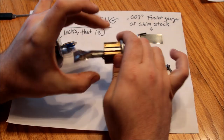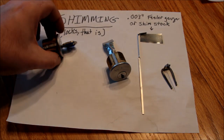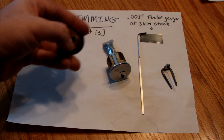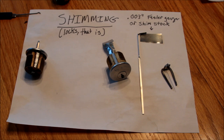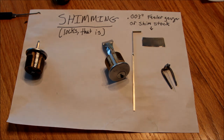Get it to the front and pop the plug out. Obviously on any well-constructed lock this will only work from the rear of the lock — we're taking advantage of the fact that we can access this little space here. On really poorly made locks you can sometimes do it from the front because the tolerances are so bad that you can get the shim in. This may be a bypass that some of you can use in your work or if you get locked out of your house. This is feeler gauge — you can get it from MSC Industrial, McMaster-Carr, or if you've got a machine shop supply place nearby they usually carry this stuff.